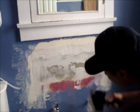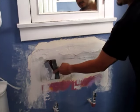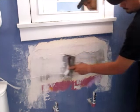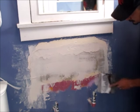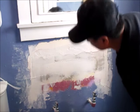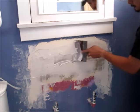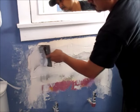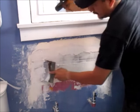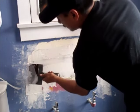This right down here is actually going to be behind the sink, so it doesn't really need to be that smooth, but I try to make it look as best I can. Joint compound when it dries shrinks a little bit, so you're going to have to fill it in anyway. You just keep going until you think you've got it smooth enough, and then on the second day you sand down and knock down what you need to knock down, then put your second coat.